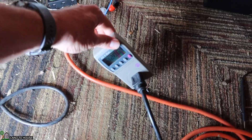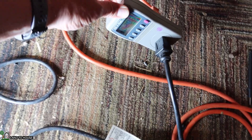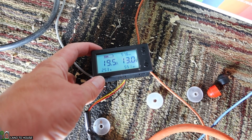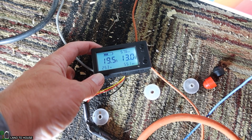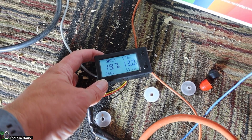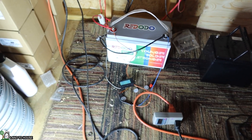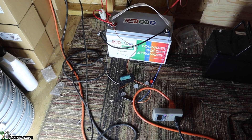Back in the studio at 2 hours and 6 minutes. The display shows 19.5 amps, 253 watts, 13 volts, 551 watt hours consumed, and we're down to 57.6 amp hours — almost halfway through the test. It's getting late so I'm going to pause here and pick back up tomorrow to finish, and I'll turn off my solar so it doesn't charge anymore.